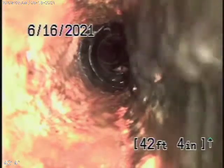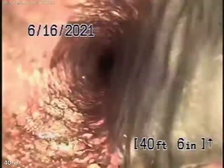Let me go inside the house. That's the clean-out outside that you see over there, and we're going to bring the camera back. The cast-iron pipe here is definitely getting a little old — there's no doubt about that, especially this section here. You definitely want to replace this pipe pretty soon — it's getting very old. I think this is on a raised foundation; if it is, then that's a much better thing. It probably wouldn't be a bad idea to replace the cast-iron underneath the house — it is getting old.